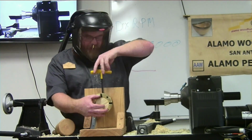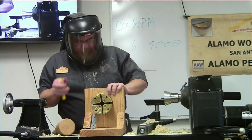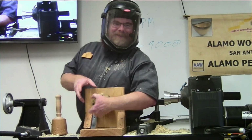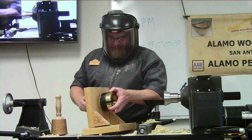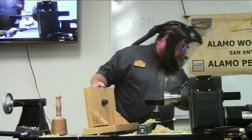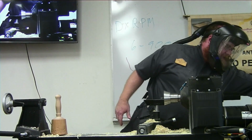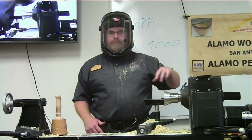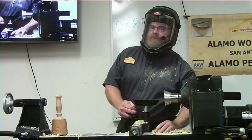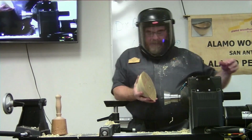Even if it's proper, that's also putting a pretty good force behind the chuck itself. So it's not going to happen easily. That's also why the more jaws you can get, that's the biggest jaw set I have, which I think is about 4 inches. So technically I can only turn about a 16 inch bowl safely with a tenon. There's differences that you can do with recesses, but recesses on bowls are a little dangerous, or can be a little bit more dangerous than chucking can be.